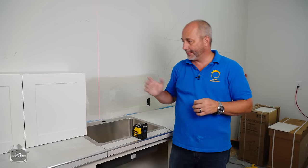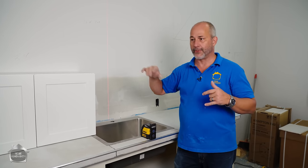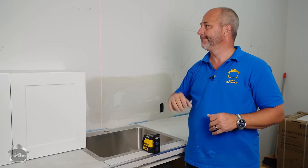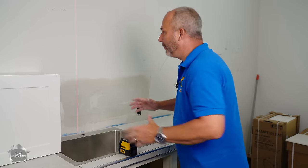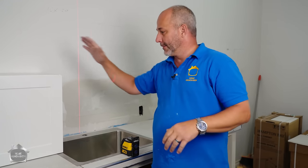Okay. If you're installing kitchen cabinet uppers, it generally is you're adding to something that doesn't exist or you're installing a new kitchen, the uppers go first. Okay. Every kitchen design, you'll put the uppers in and then you'll do the base cabinets because it's too hard to stand off the wall like this all day long. It'll kill your back, right? So you put in the uppers first.